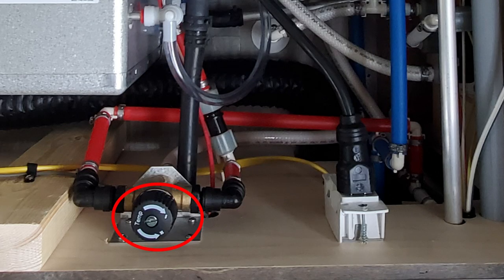When you test the hot water, run the water for a few minutes, not just 30 seconds — that way you can tell that the water will stay hot. Sometimes, especially with the tab, you may need to adjust the mixing valve on the hot water heater.